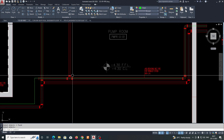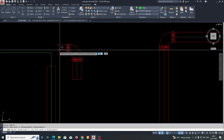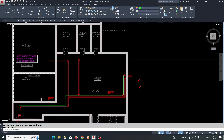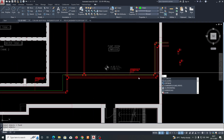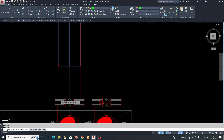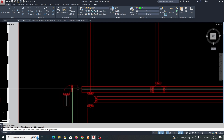Using dynamic blocks and other tools, move this one over here, then mirror it — mirror and flip — and place it over here. Move it up and flip as needed so it goes to the other area. Delete the extra lines so the pipes come up correctly. For another riser, start from here, go up, move it to the center line, stretch up, draw the pipe, and copy this one. Add one pipe over here in the center.